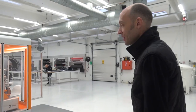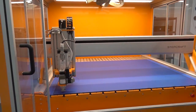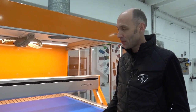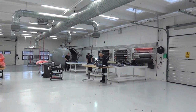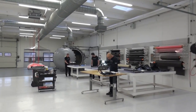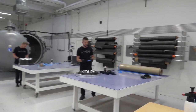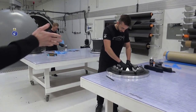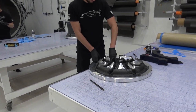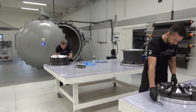It starts in this 2D cutting machine, which is basically cutting the carbon fibre material. This is a pre-preg carbon fibre material — it has the resin embedded into the material, which means when you get it out of the freezer where it sits, it has to be worked on within about two days, otherwise it starts to harden. Over in the other end of the room, two of our technicians are working on the moulds for the wheel. This is where we do all the parts for the car. The autoclave in the background is where we do all the body parts. Here we're doing the front part of the wheel — the face — and that's the back part. Over there you see the two mould parts put together so that the wheel is complete.